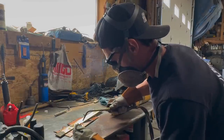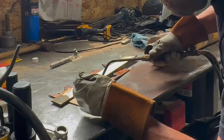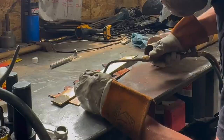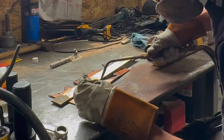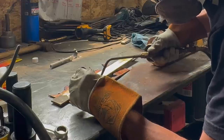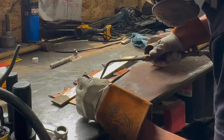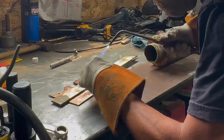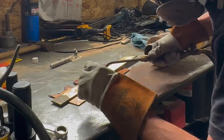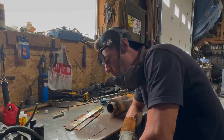For those wondering, my acetylene regulator was set at 4 psi and my oxygen was set at 40, and in hindsight that was probably too high on both. So I'm just heating it, dabbing it in a little bit, heating it, dabbing it in, and trying to get it to lay in there. But it's getting sucked into the joint, and I think it's because it's such a deep joint that expands for quite a ways. I think that second one was close to what we needed. It's definitely not perfect but I'm going to let it cool down and we'll see what kind of results we got.